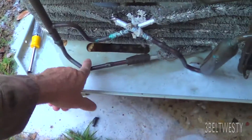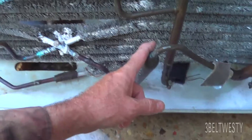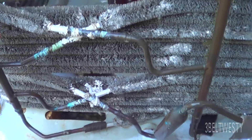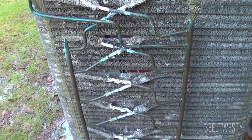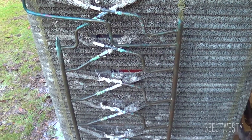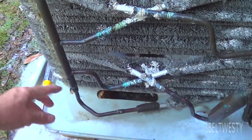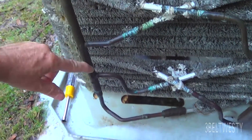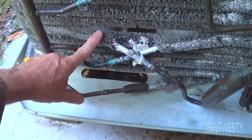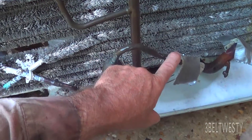It takes one final pass and goes around the bottom coil. It comes out and goes through the dryer. So you've got actually 7 different sets of coils — the 2 vertical copper pieces have 6 coils. And then in the final sub-cooling, what they do to get even higher efficiencies is take the bottom end of this liquid after it's condensed and run it through the bottom set of coils, then it comes out through the dryer. And of course that's a 3/8-inch line.